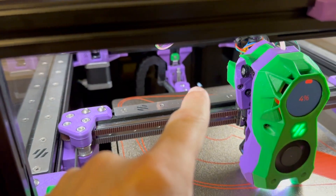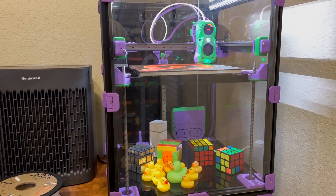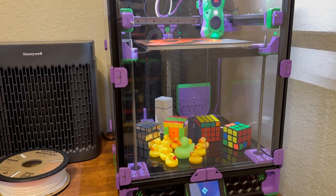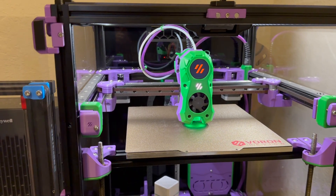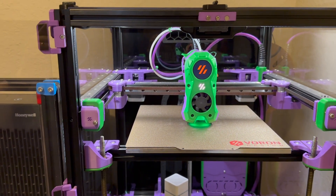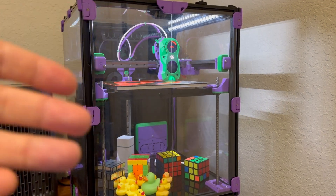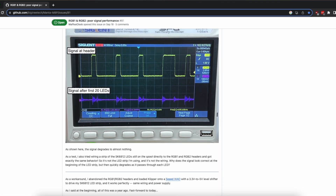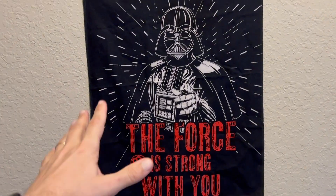I think overall the swiper is not the best option compared to a brush, but I don't want to wear off my CHT nozzle — it's quite expensive — and alongside the purge line it's actually doing a pretty good job. You can see small pieces of filament all over the place. There's a little issue with the LED lights: they're only controllable when the printer is not printing, but I have them always on and don't really care about it. I'll leave a link in the description to the topic where the problem is described. Nevermore is working perfectly fine. Thank you very much for watching — let the force be with you, see you at the next one, bye bye!